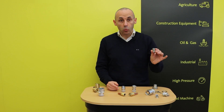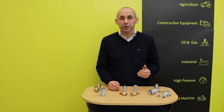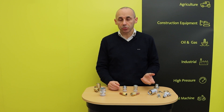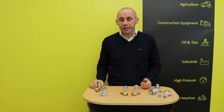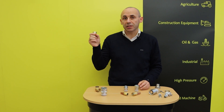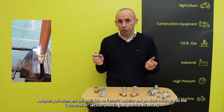Sizes go from one quarter inch up to one inch, and for some sizes it is also available in the brass version. Brass ensures a higher resistance to corrosion compared to steel. As for the installation, one of the most common ways of installing RF male couplings consists of sourcing a brass adapter and brazing together the adapter and a copper tubing.